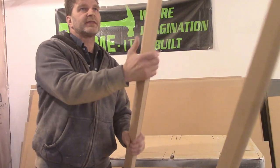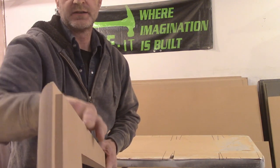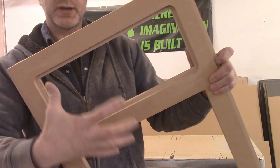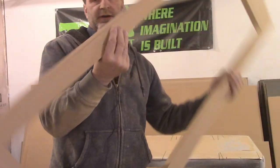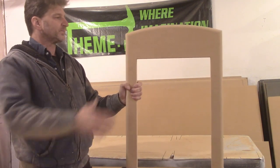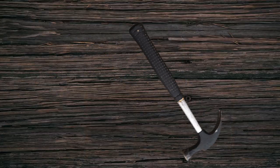I finished rabbeting it all out with the router bit. We have our big round-over here, and we milled that out so I can attach a side and the top to it — something to nail and glue to. On the inside bottom I also rabbeted it out so I can put a panel inside and light it up or put a logo in it. You can theme these however you want — shell, Texaco, or many different gas brands. Now we want to build some boxes to attach this and get it looking three-dimensional, so let's build some boxes.